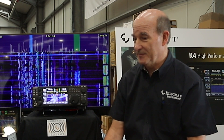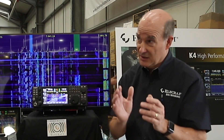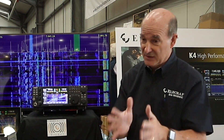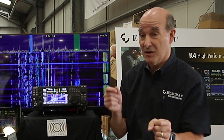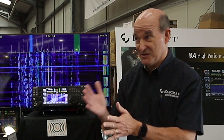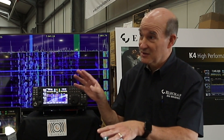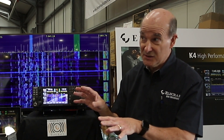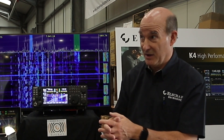We also have the ability to upgrade across three different models: the K4, K4D, and K4HD. The base K4 has a single analog-to-digital converter and can listen to two frequencies at the same time on one antenna. The K4D adds a second antenna path for diversity reception, letting you listen to two antennas oriented slightly differently on the same frequency, or on different bands with optimized antennas.